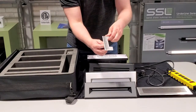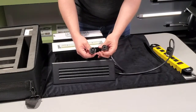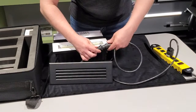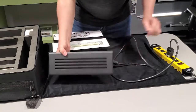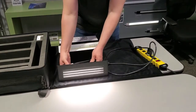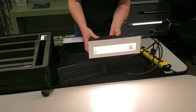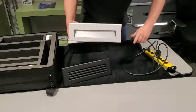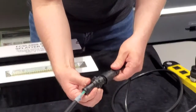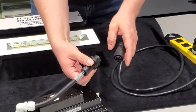This shows how that screw looks, with the center pin and the Torx head. The quick connect keys into the pin connector on this fixture so you can't misalign the pins. Plug it in and turn it on. You can also unplug and plug it into here. This twists a little bit — you kind of hear it snap, it'll key in. Twist it and pull away to disengage it.